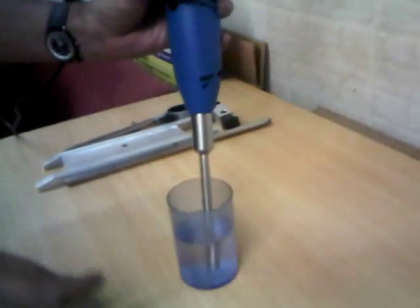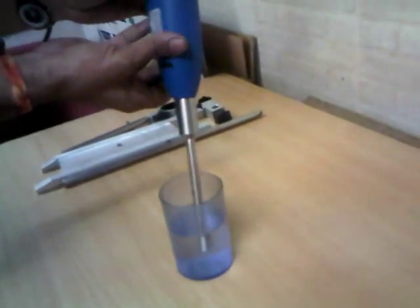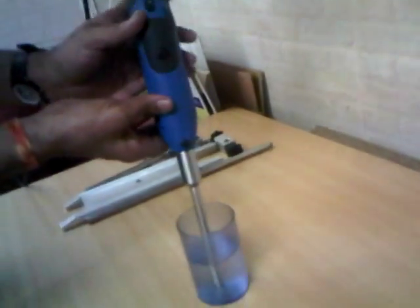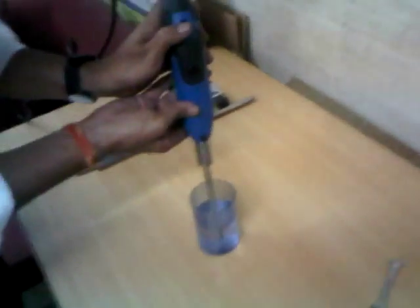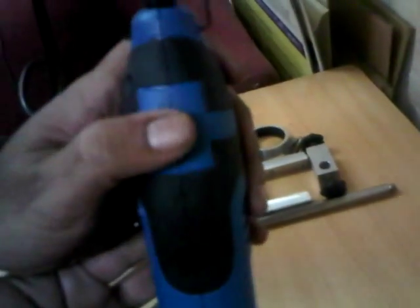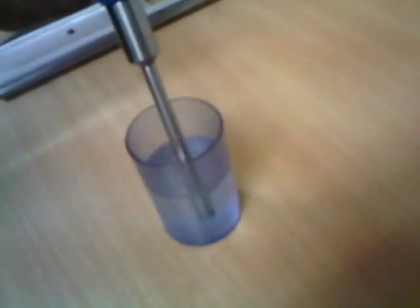At this point the machine is running at a very low speed, the minimal speed. This machine can run from 5,000 RPM to 30,000 RPM — at position one it is around 5,000 RPM. If we have to increase the speed, move this speed setter down and the numbers will keep increasing. At the maximum position the motor is running at 30,000 RPM.